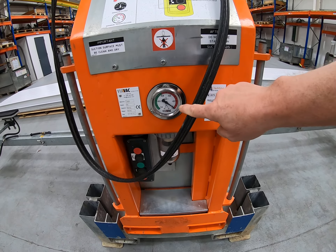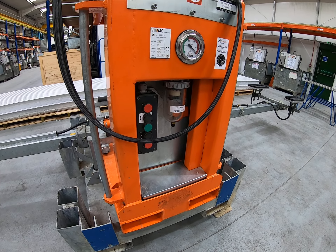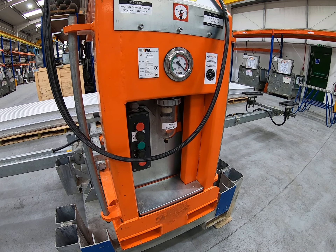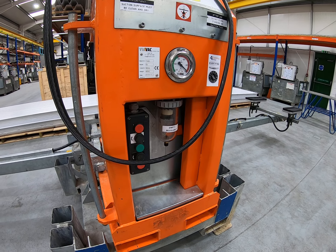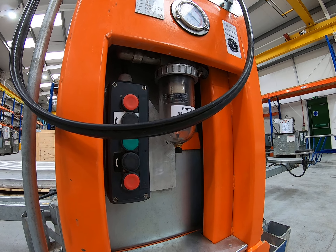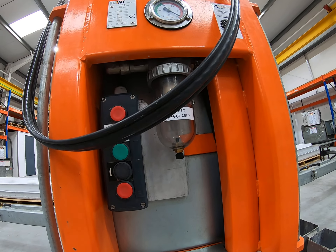Also on the front of the machine you've got the vacuum gauge — I'll talk through that later. You've got a water separator here. With the Rotoboy, as with most of our lifters, you can lift wet panels and operate in wet conditions, but you need to keep your eye on the water trap because any water in the system will get sucked through and accumulate there. After a session of lifting in wet conditions, switch the machine off and simply drain it by unscrewing the black screw here, let the water drain out of the separator, then reinsert the black screw and tighten it. Please be careful because it's a plastic thread in a brass housing and it's all too easy to cross-thread it, so take care and don't over-tighten.